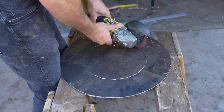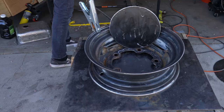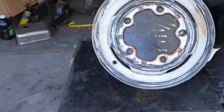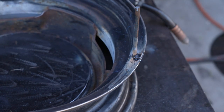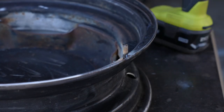I want the rim that I'm going to use as a base for the fire pit to catch all the ash, so I just cut another circle of steel and welded that inside the base rim. The rims stack nicely but I don't want them to slide off, so I also welded in some steel rods and trimmed them just so they'll catch the second rim and keep it from sliding off.